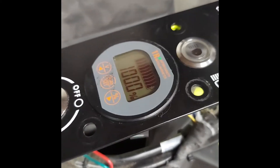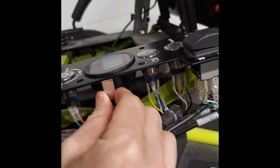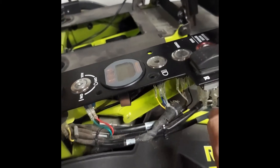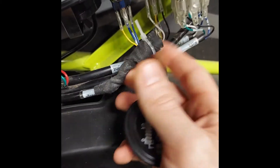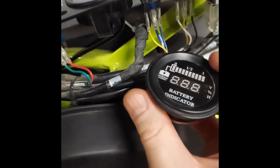What I couldn't get with the step bit I smoothed out with a curved metal rasp to make the hole just right. This gauge comes with a bracket and wing nut to secure it underneath, similar to the original. To get access to the control panel there are some plastic pieces with star-bit nuts you'll want to take off. The original connectors for the back of the original gauge — I just taped them up and zip-tied them. They don't need to be connected to anything, and this way if anyone ever wanted to switch back to lead-acid they could reinstall the original gauge.